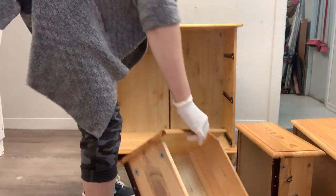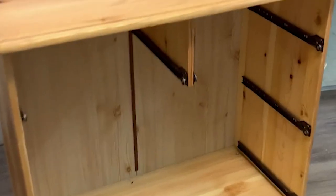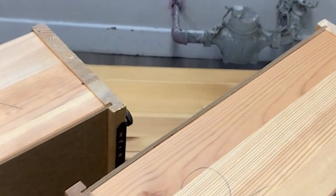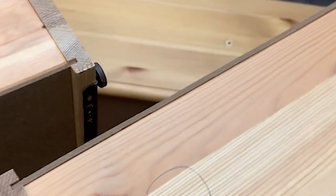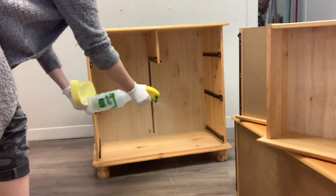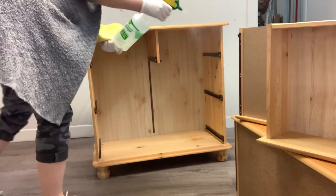As I'm removing the drawers, I like to number them. It doesn't make as big of a difference with newer pieces, but whenever you're working with an old vintage piece of furniture it's very important to number the drawers. Older pieces can be finicky — if you put the drawers in a different order than they were originally placed, they may not fit properly. So I'm just in the habit of numbering my drawers whenever I take them out.